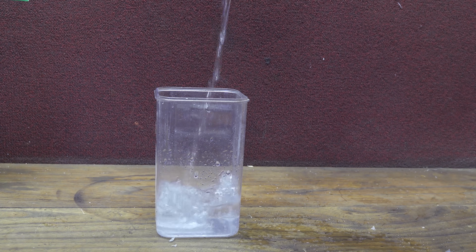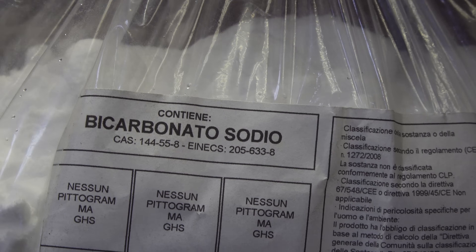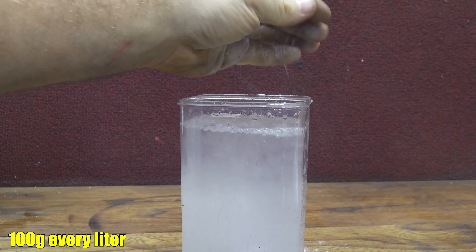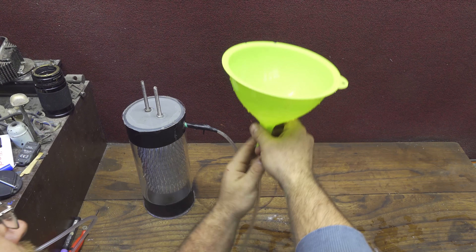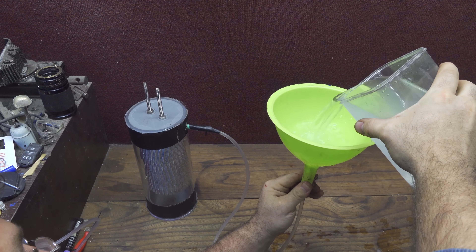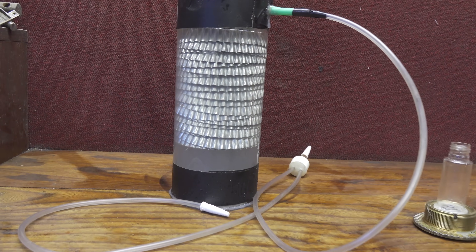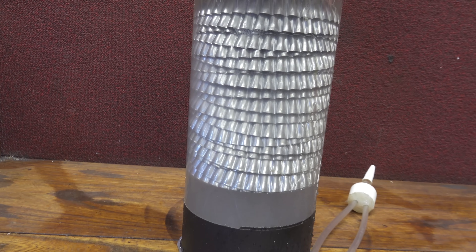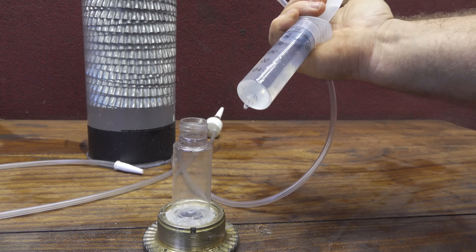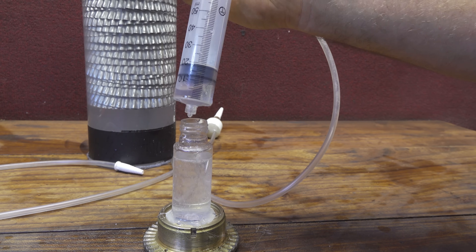Let me take a container so that we can mix water. This is distilled water and I can mix it with baking soda, because distilled water works like an insulator and doesn't conduct electricity at all. I need baking soda to create a highly conductive fluid. I then pour this water inside the main container, filling it up to cover all the stainless steel plates, stopping about half a centimeter under the exhaust tube. I also fill the little shampoo container with plain tap water.